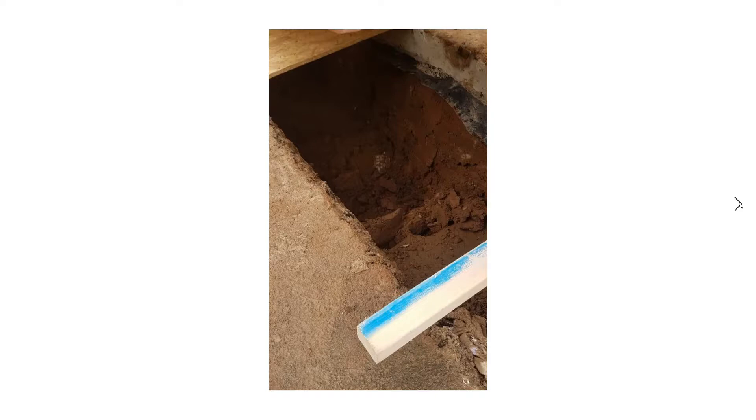What actually happened was they didn't allow me to build on top of the floating slab. The slab was six inches and it was reinforced, so what I had to do was cut the original slab back about 500 millimeters through the reinforcement, take all that concrete away, dig down approximately a meter deep, and then put some foundations in for the new wall to sit on. I got a quote from a builder to supply the window, cut the slab, and build the inner and outer wall with the foundation — that came to two thousand pounds. Doing it yourself, you can save quite a lot of money.